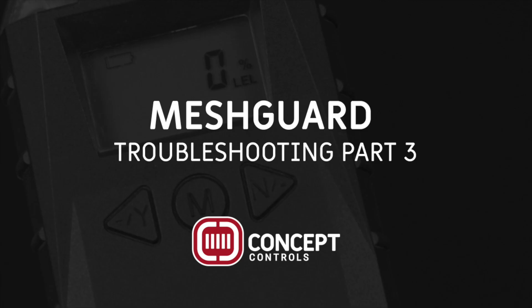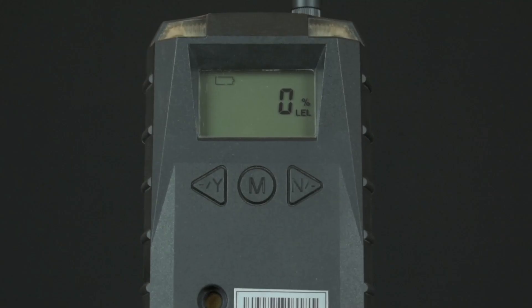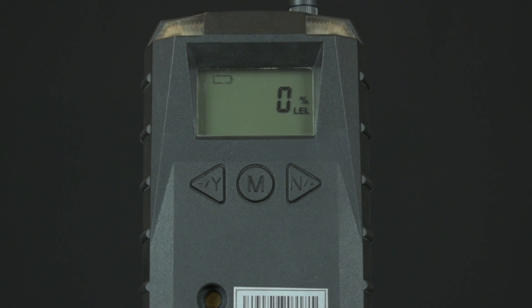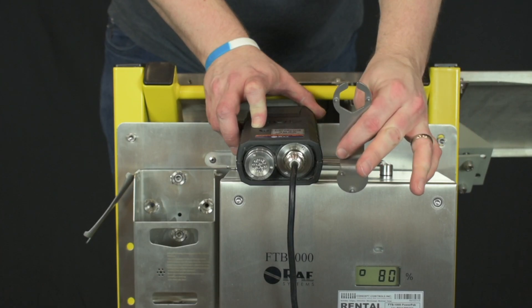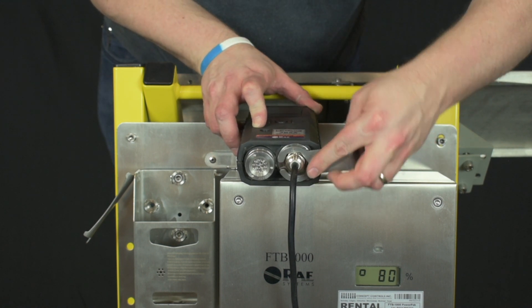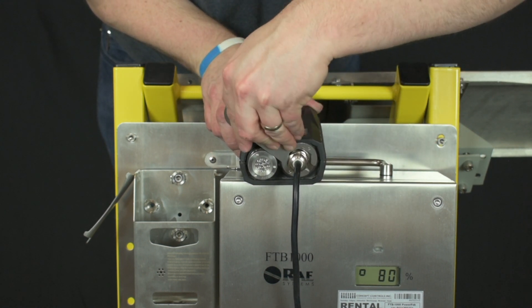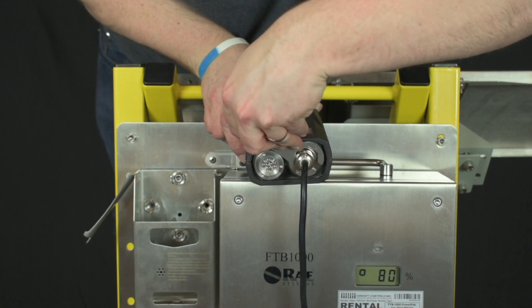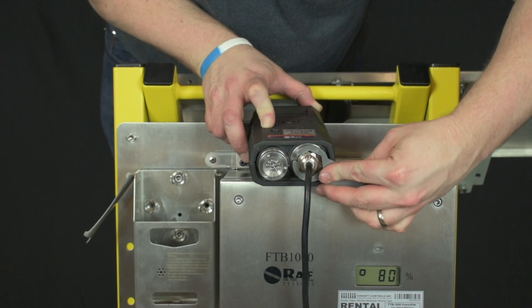Part 3: Detector Battery Issues. If you have a low battery warning pop-up in the top left-hand corner of the detector, the obvious fix is to change the battery. We have seen this pop-up though with fresh batteries installed — normally this is caused by a loose connection on the detector. Grab the special open-ended wrench supplied with the mesh guard system and cinch down the power connection. You will need to turn the unit off and back on again to reset the alert. If this doesn't work, you'll need to send the unit in for service.